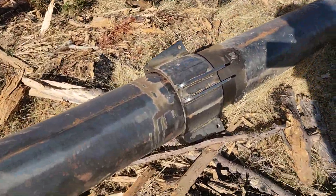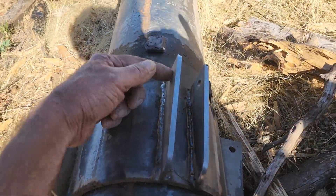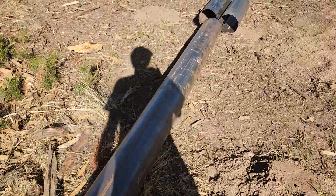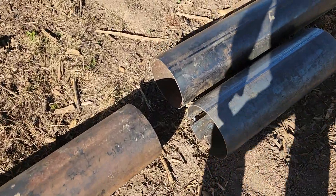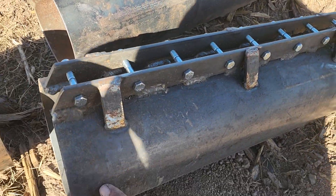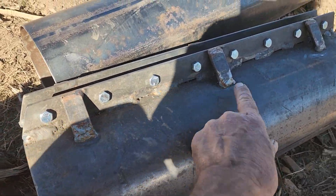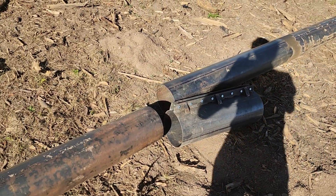This is how we'll attach the top anchors. The top wires will have a bolt through here with the cables coming through. Here's a tower coupler — let's see how we make it. We just split a piece of 8 inch tubing and it springs open, and then we've welded our stock here with some gussets to strengthen it and a whole bunch of bolts.